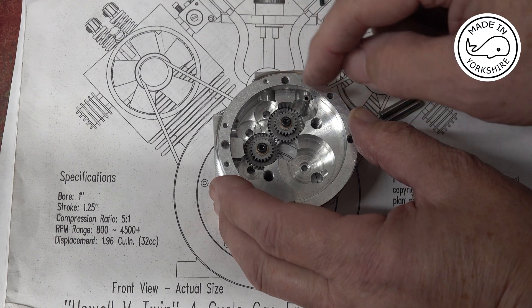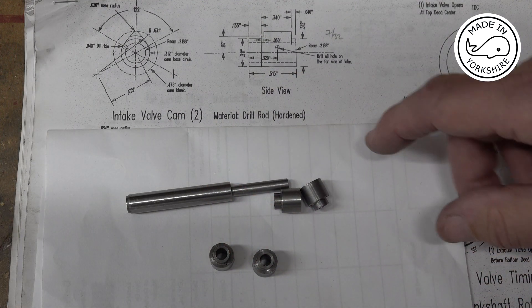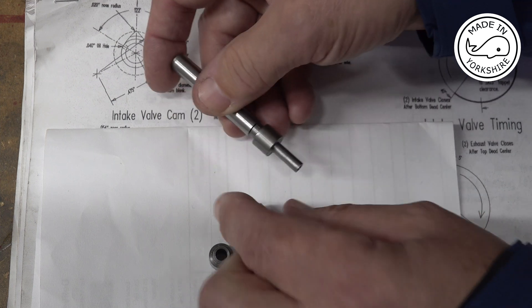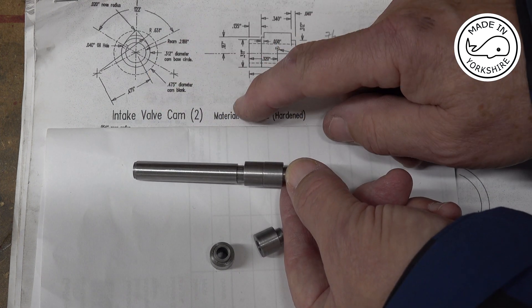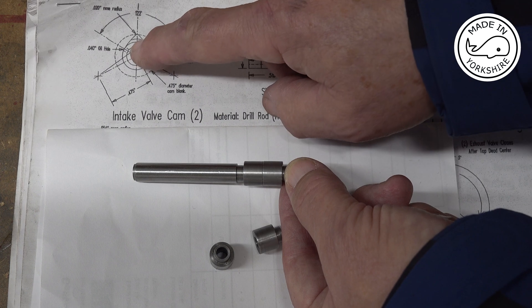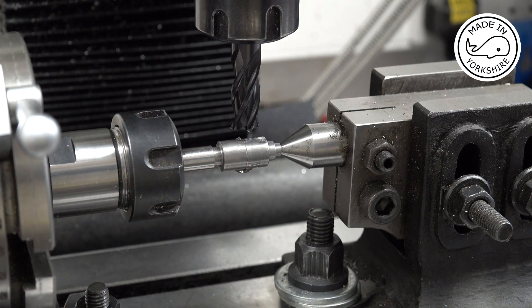What I need to do now is to make the cams that will fit together with the actual gear. I've got four cam blanks and the idea is I'm going to put two on this mandrel, using super glue or something like that. For the intake valve I'm going to machine these down flat — two flats, 122 degrees apart. The plan is to take about 81 thou off to get down to this level here. I'll go in 10 thou increments.